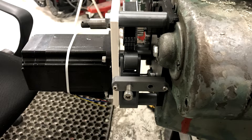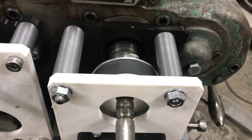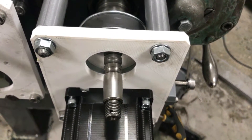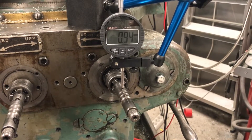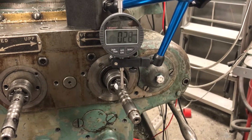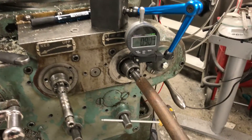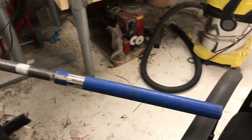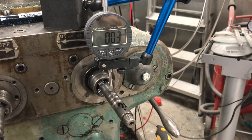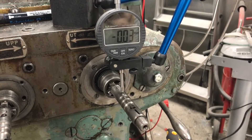Since I figured it would be really difficult to get the belt tension perfectly, I designed this over-complicated belt tensioner. With both Z and Y having their plastic templates mounted, I decided to check how well this would work — and I instantly saw a big problem. The shafts are quite bent, which will constantly change the belt tension. With a digital indicator I could check more carefully exactly where it was bent and by how much. I took some random scraps and used a cheater bar to carefully bend the axles back. They didn't seem to be too hardened so I hoped they would not break. After carefully pushing and pulling on the axle, I managed to get it down within a few microns, so the belt pulley should not wobble.